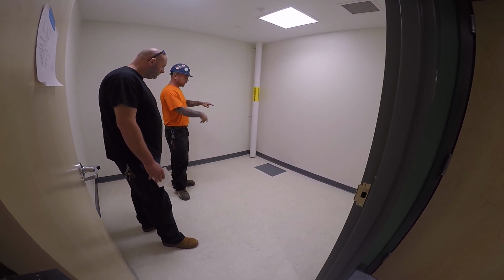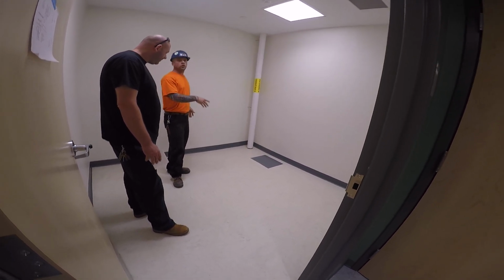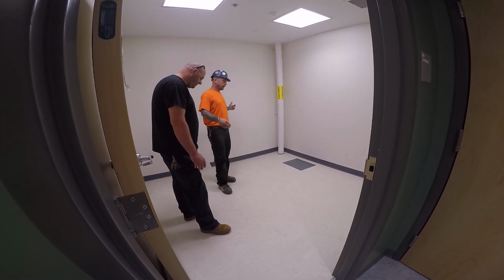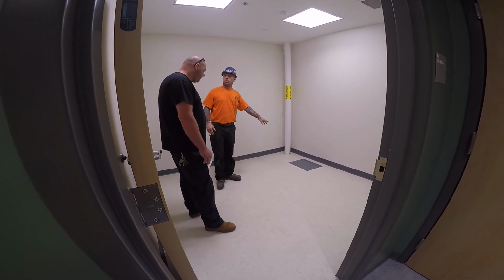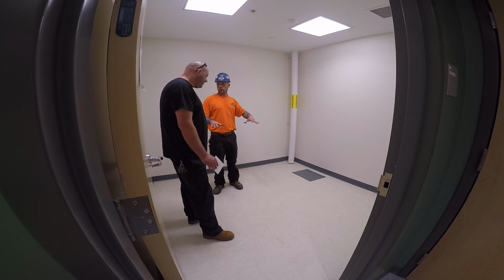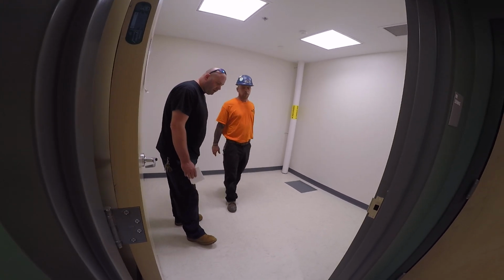Any of those pads, you're going to see one more of those in the kitchen, and then there's another one in the kitchen, but it's got the stainless. The grease trap's different, it's a lot larger. But there's another one for the front entranceway, for the drains that are outside of the kitchen. They come right into the backwater valves also. One of them looks exactly like this. The other one actually has a stainless diamond plate over it in the kitchen, because it was in the main entranceway and it made it look nice.